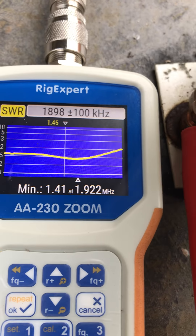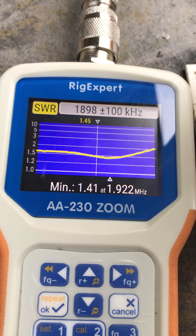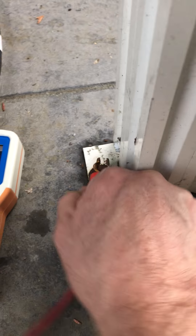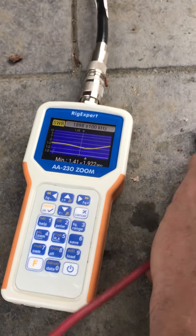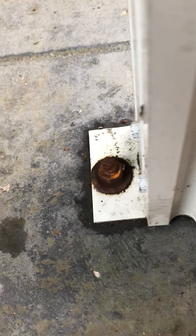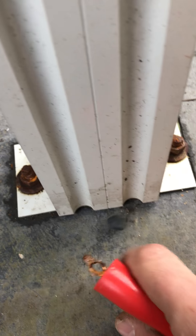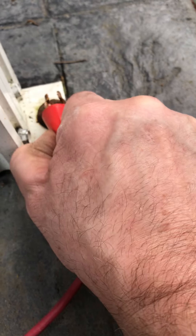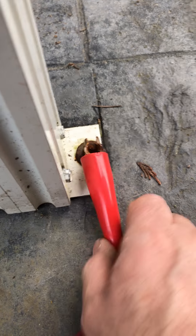It's a little bit high there — the lowest SWR is a little bit higher than the band I'd like to be, but that's okay. What I wanted to show people is if all I have to do is just move this to the other bolt — I don't understand this at all. It's on the same aluminum plate. I'm going to put this in here. It's a little more rusty, but I'll grind it in real good. It's really no more rusty than this one.